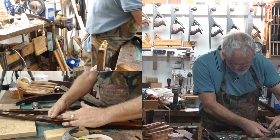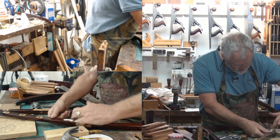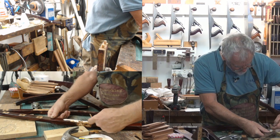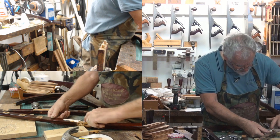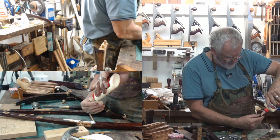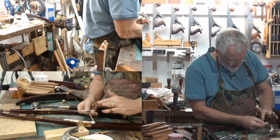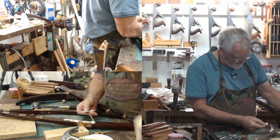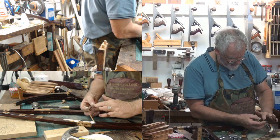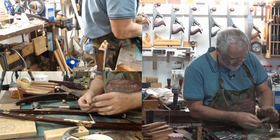And what just happened then is going to happen in at least 6 out of 10 chairs that you repair, especially if they've been repaired before, because I think someone before said, oh, just epoxy. Yeah, great. If they've used epoxy, that's really strong glue, and they actually tell you the timber will break before the glue gives way. That is another reason I love hide glue, because I can heat that up. If that was hide glue, all I would have to do was put a bit of heat into that and it would just separate. It'd be messy, like chewing gum, but it would separate.